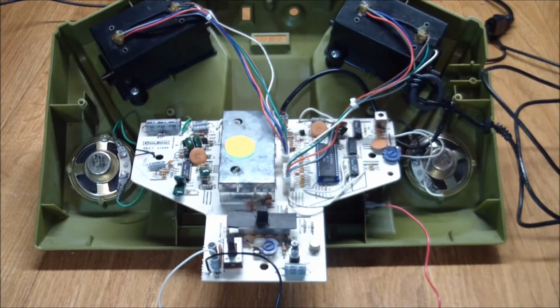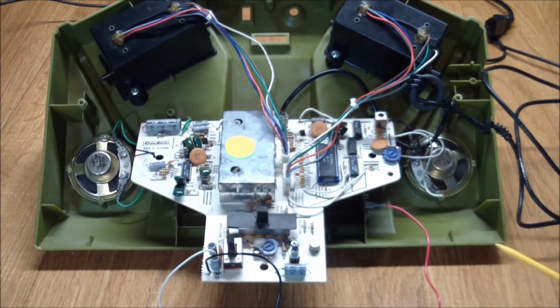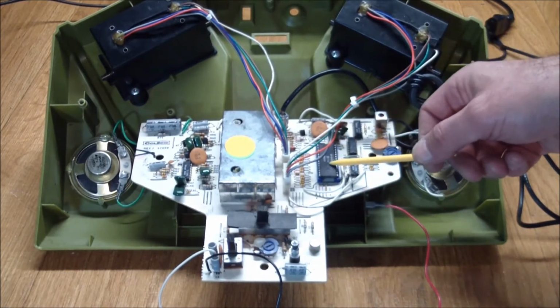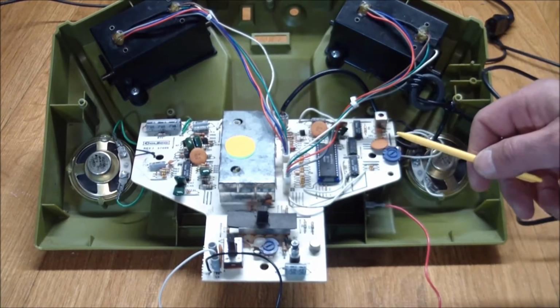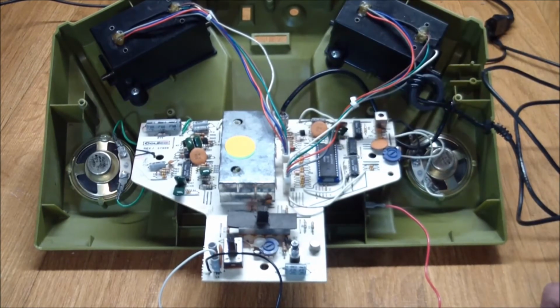So here's the PCB. Nothing much happening on here. The heart of it is this 28-pin chip over here. It's a General Instruments AY-3-8700-1 with a date code of 7745. And the way these work is, I don't even think they have ROMs on them. They're actually hardwired, like early Atari games, to play all of these tank games. And you need a little bit of CMOS glue logic outside to select the proper game.